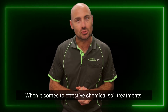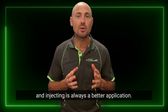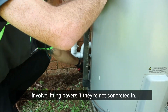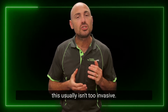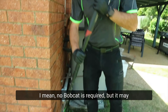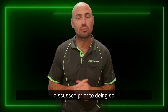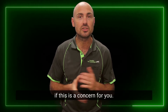When it comes to effective chemical soil treatments, any areas we can trench instead of drilling and injecting is always a better application. These areas can be grass or a lawn, a garden, or it could involve lifting pavers if they're not concreted in. Given the treatment is only a few hundred mil off the building, this usually isn't too invasive — no bobcat is required — but it may mean disturbing some lawn or removing a few plants too close to the building. This would always be discussed prior, and there are alternatives like bait stations if this is a concern.